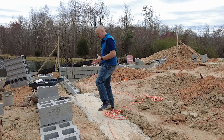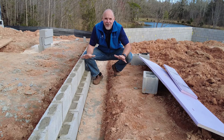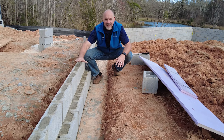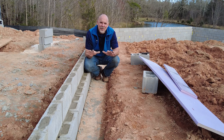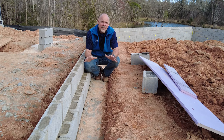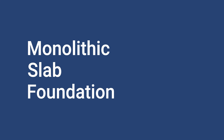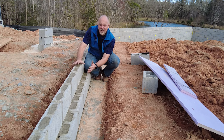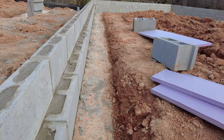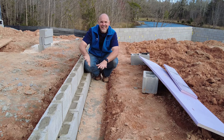You can follow me down on this footing and see this section where we've reinforced the wall. Now you can see this foundation come into shape. We lay this first eight-inch block and then a four-inch on the outside of it to create this ledge for our concrete. This is what we call a stem wall slab foundation — we feel this is the easiest slab to insulate to create a high-performance foundation from an energy and comfort standpoint. This stem wall gets its name because we're laying a masonry stem wall that sits on a concrete footing, and this stem wall will actually support our slab with this ledge, which also gives us a great perimeter to insulate very easily.